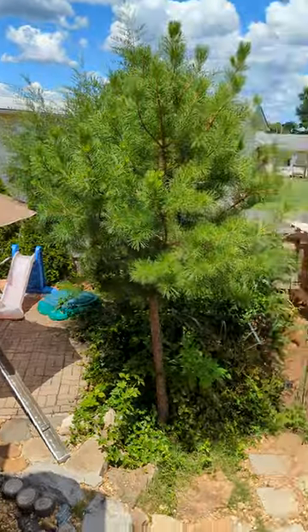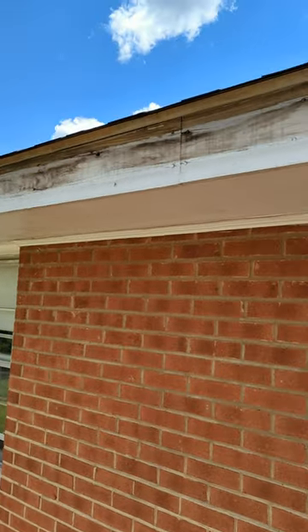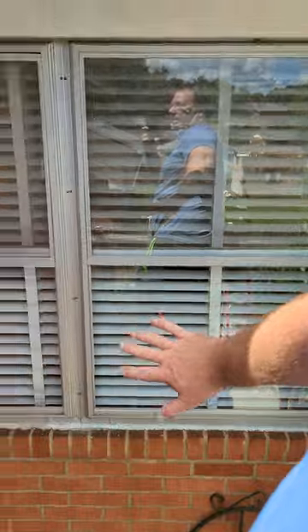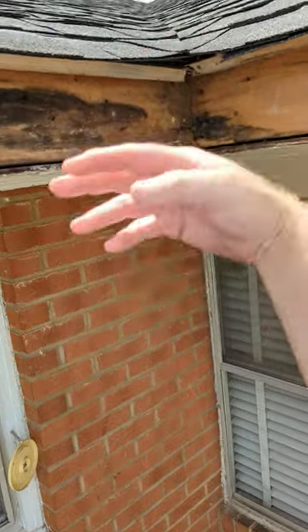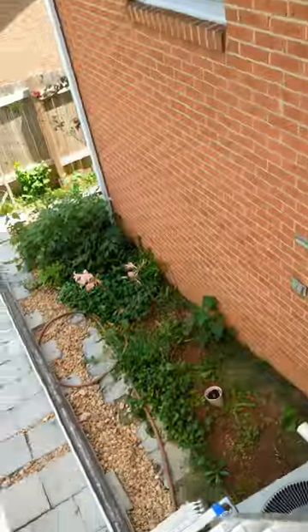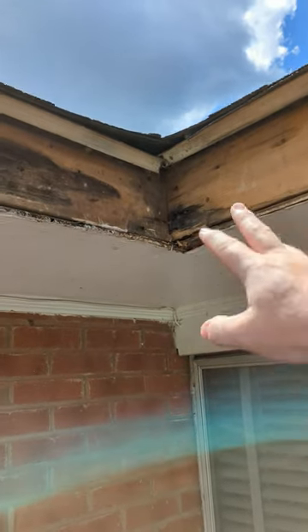When we bought this house ten years ago there were signs of wood rot, so I'm finally dealing with that. It's not that bad. It looks like when they added this addition, the way the water flows, all these tiles work fine — it was just the water was washing and splashing and going crazy here. The sun rises up in that direction and goes that way around, so it doesn't get much sunlight here ever, so it could never dry out.